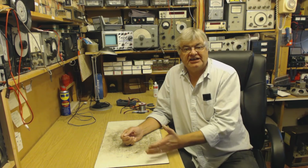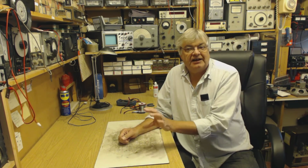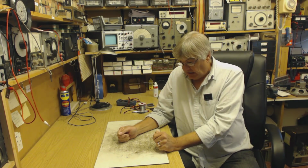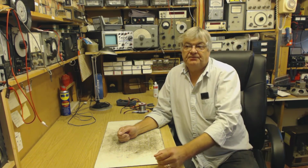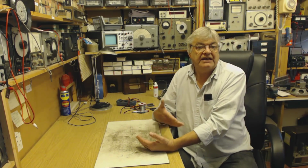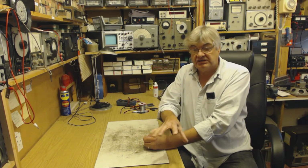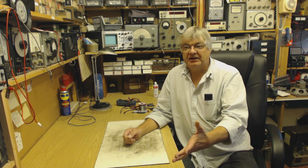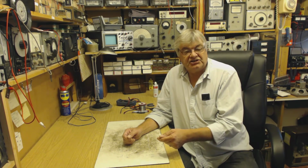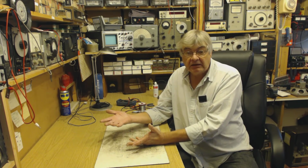So I'm listening to the station. It's only on strong stations, and I'm getting quite a loud hum on the local BBC station. It's coming down the mains. This is the mains acting as an aerial, coming into the radio. The mains, the 50 cycles, or 60 hertz in America, is modulating the radio station signal that's also coming down the mains into your radio. So the radio is humming.